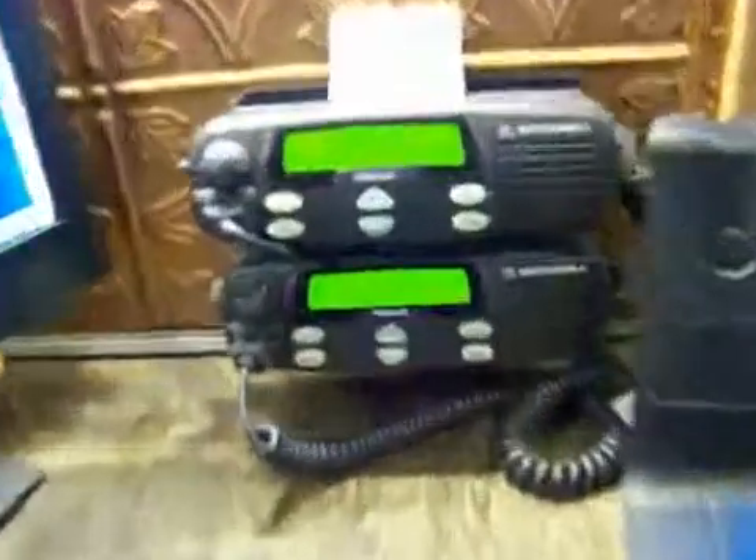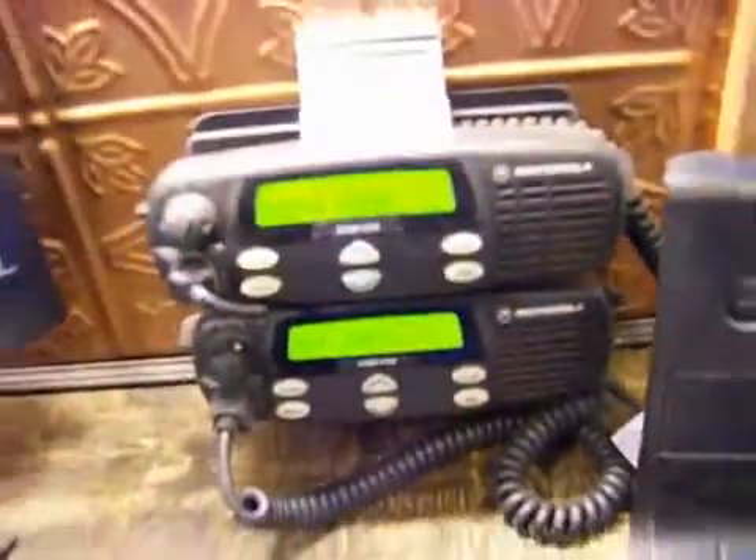This is on Newport. Now I'm going to transmit on my portable. Since my portable is UHF, it's going to have to go through an extender system — it's going to go out to my vehicle. You can see: zero zero zero one. So this radio has four slots for an ID number, whereas older radios like the Radius and the MaxTrac only have the capability of displaying two of those digits.